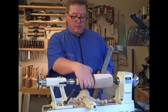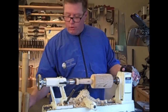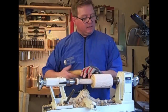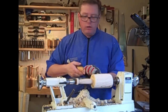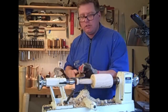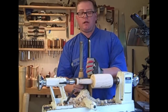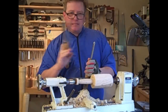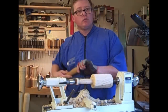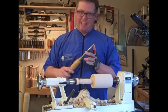In case you haven't been able to tell, I'm making a woodworking mallet. Now I'm going to switch to my third tool — this is called a spindle gouge, and this gives you the artistic control in spindle turning. Notice the difference between a spindle gouge and the roughing gouge: the spindle gouge has a curve along the top, versus a roughing gouge which is straight across the top. This gives me control. The roughing gouge basically only has one bevel — you go straight across — but with the spindle gouge I can create round overs or coves.